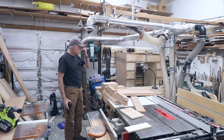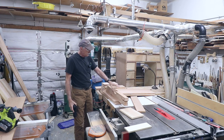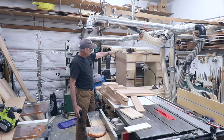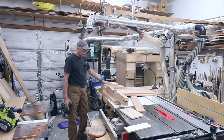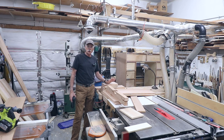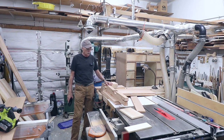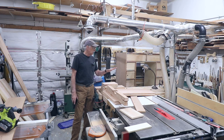Okay, these are all the parts for the drawer fronts, the front doors, rails and stiles, panels, top drawer fronts and the bottom drawer fronts and all the 8 little ones. What I do need to cut out is long strips of 1/4 inch stock to make the bead that's going to go around all this stuff. So I've got plenty of wood left over to do that with. In fact, I've got a nice chunk of cherry over here I'll figure out what to do with.